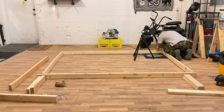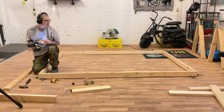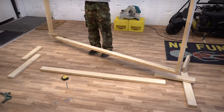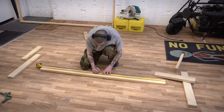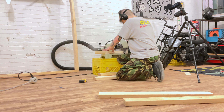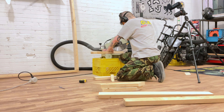Finish all the floor corners. Next we're going to eyeball the cuts we have to make for the leg supports. You can set aside this part of the frame while we finish up the legs. Now I'm marking the center of the 6 foot piece that I'm going to cut in half to build the legs with. All of the leg supports need to be chopped to 45 degrees as well. The foot sections of the build end up being about 2 foot long and 3 foot high. I'm also cutting the edges of these off at a 45 degree angle — it's not necessary but it looks slightly better and I'll stub my toe on it less.